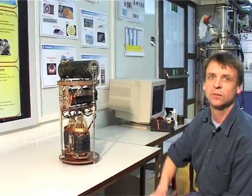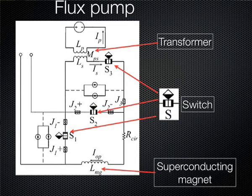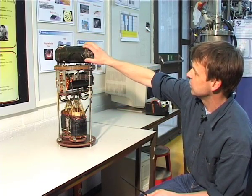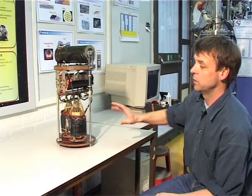There is a niobium-zirconium material used as the material that will be switched. With this, you can apply a current of like 500 amperes to this load, while you have a control current of less than an ampere.